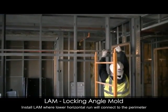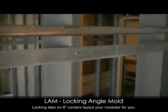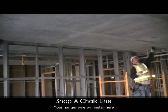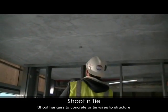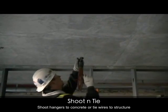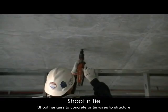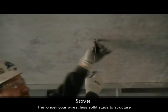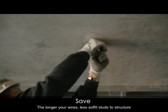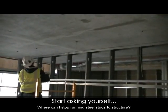Install locking angle mold where the lower horizontal run of your soffit will connect with the perimeter wall. A chalk line marks the location for your hanger wires. Outside of this demonstration setting, where plenum depths are likely to be much greater, wires may run 5, 10, or even 15 feet with ties to structure or anchors. Steel studs that are eliminated through this process equal dollar savings and quicker construction schedules.